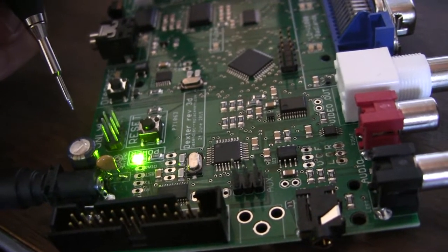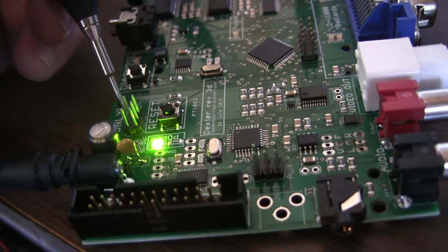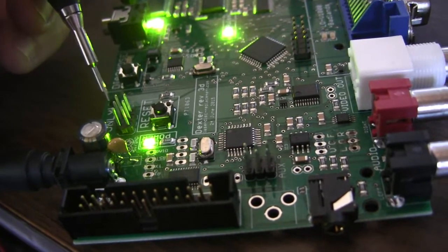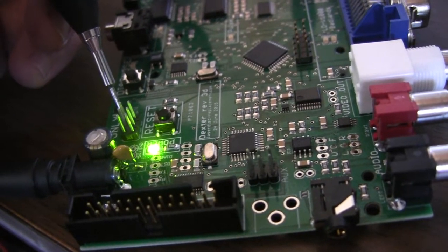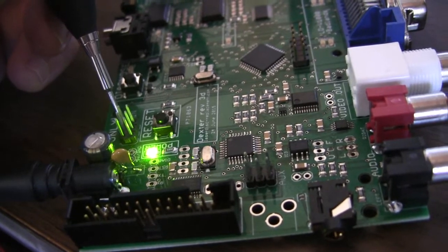It's actually very common, very standard, so it's probably really well documented, but I'm just observing what I'm observing, and all these pins seem to be floating. So I'm going to poke around a bit more on the bad board and see if I can find what's pulling this high. It could be that the microcontroller is just bad and that's what's pulling it high, but hopefully I can find something.